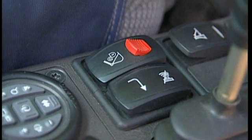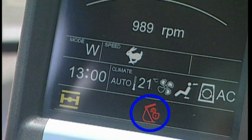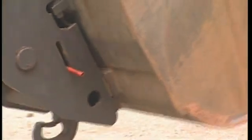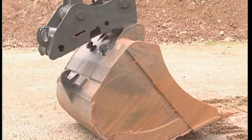As the operator, make sure this switch is always intact and functional. If you should touch the switch by accident, you won't lose the attachment because the switch is unable to move down. A warning symbol is then activated on the display and a buzzer sound can be heard to warn you that the attachment is now unlocked. A red mechanical pin will move out from the QuickFit body to inform you and anyone in close vicinity of the excavator what is happening.